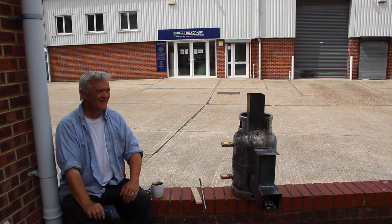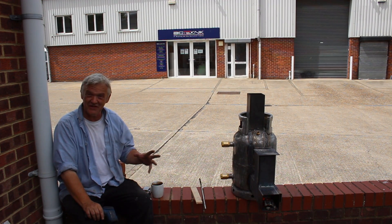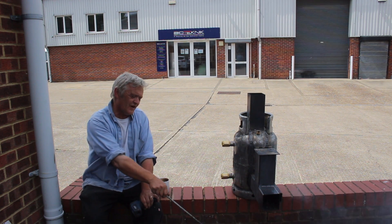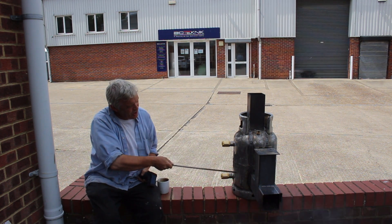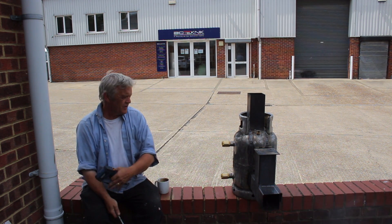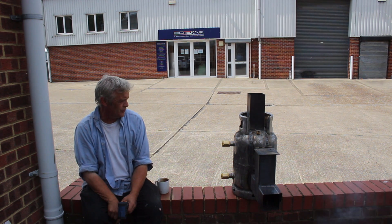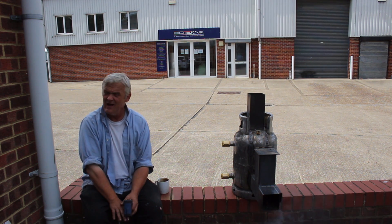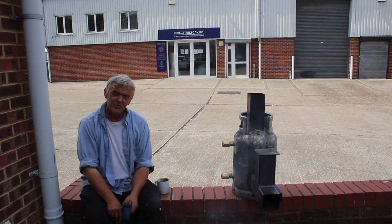It's pretty fantastic. This is not a day to be doing this — it's the middle of summer and I'm sweating. It's had an hour's burn; I've raked all the coals out so it's now all by itself. Readings are 88 degrees here, 440 degrees there, and 158 degrees there. We can calculate how much thermal energy we've put in — about 40 kilograms of sand, using about three or four kilos of pine wood. Now all we do is wait for it to cool down to ambient.